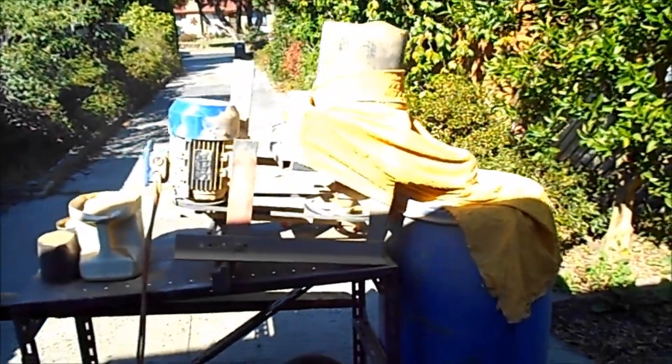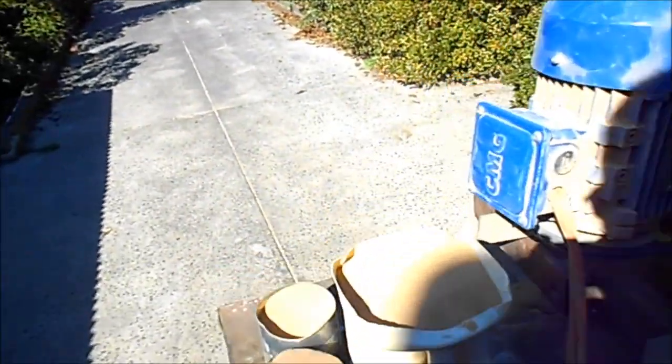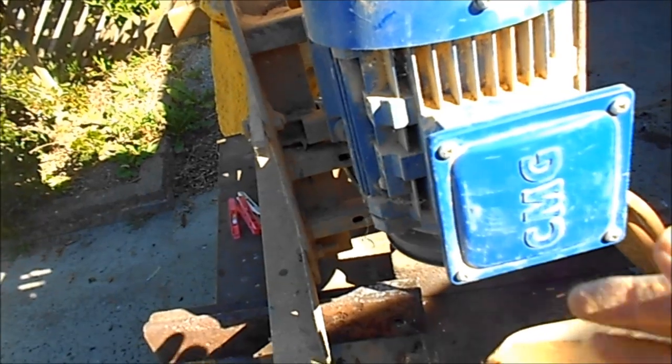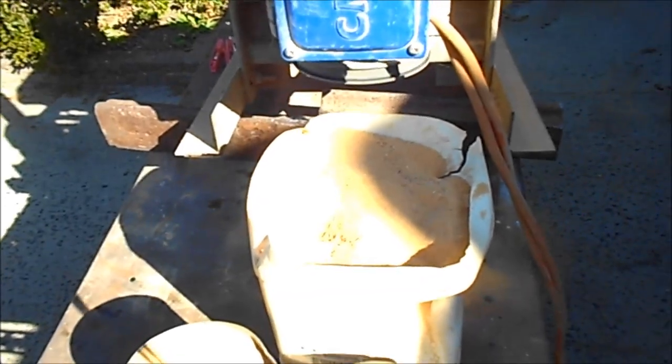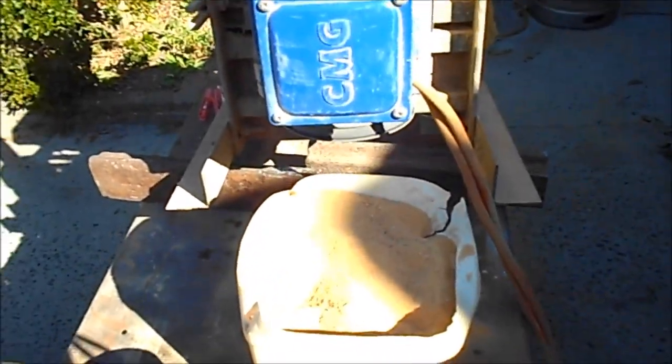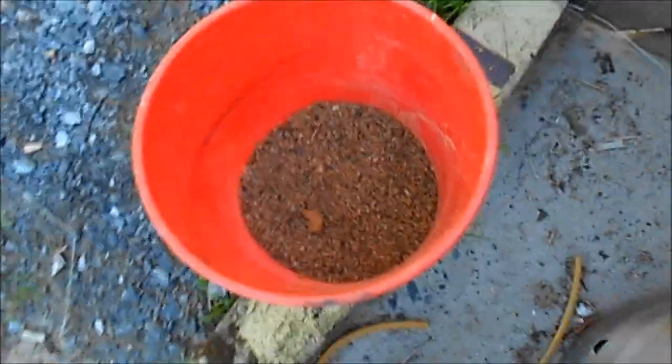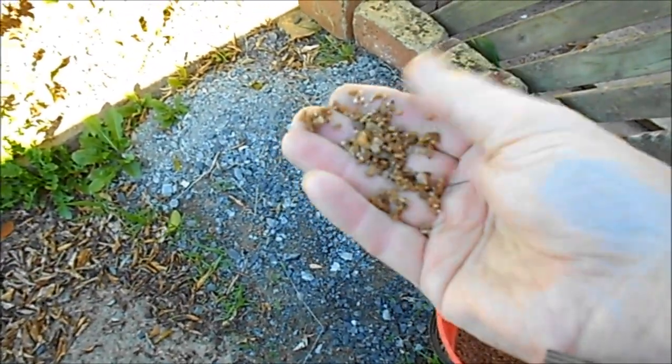I feed the machine with two different types of sand. Firstly, this stuff here — this is brand new moulding sand straight out of the ground, but I've dried it, crushed it, and passed it through a tube that's got about one and a quarter mil openings, just to get rid of the coarse lumps of rubbish in the sand. There's a bucket that shows some of the coarse pieces that came out — largely little quartz pebbles, which you don't want in the sand and are a bit hard to grind up.